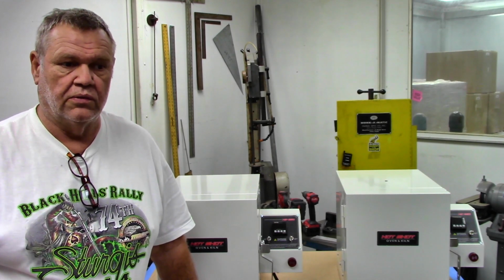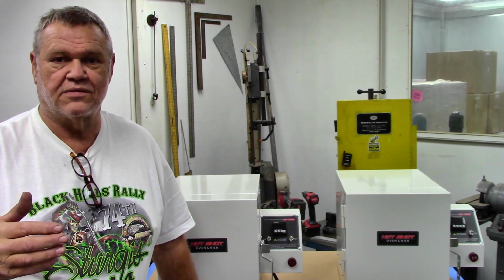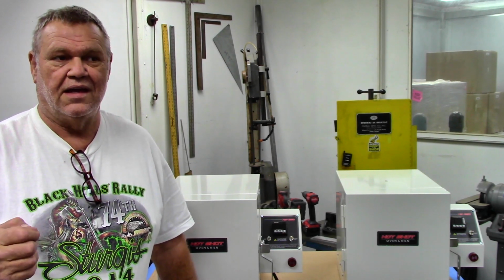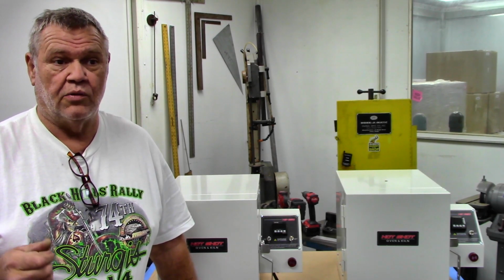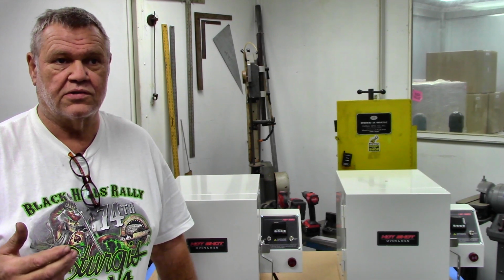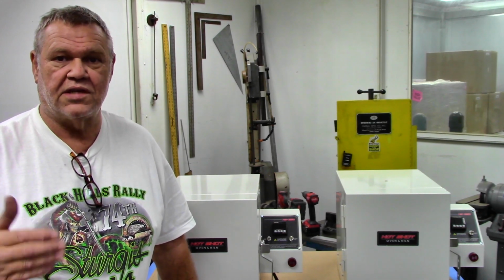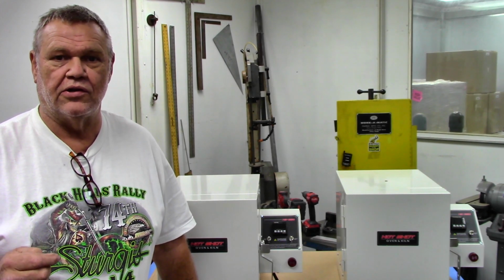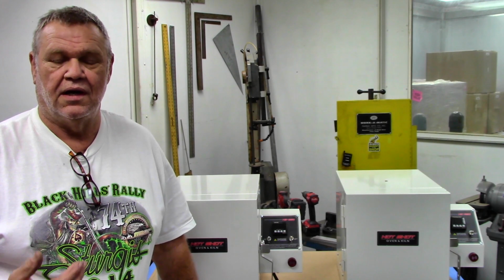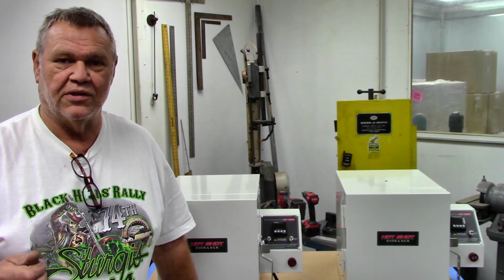And we went through, and one of my first guinea pigs was over in Australia, and they only use 50 hertz there. But when you talk about heating coils, Ohm's law does not contain frequency. So frequency really has no bearing on your heating value. So when you stop and think about it, it really doesn't matter.